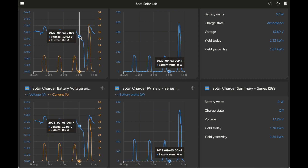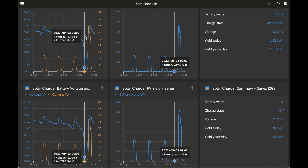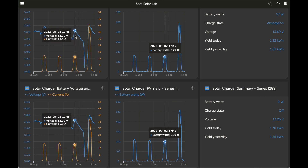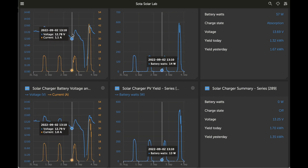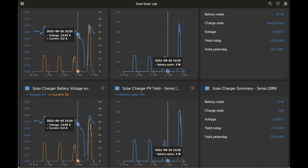I think I'll allude to this later in the video. We did lose — our batteries did go to low voltage cutoff because this 600-watt array was not keeping up with our loads. We needed at least a thousand watts to make that happen. So I think we've got another test coming up with those. Definitely be looking for that one.